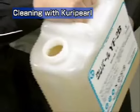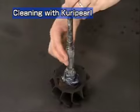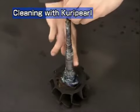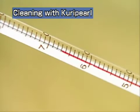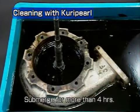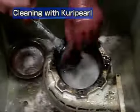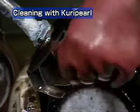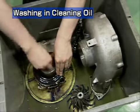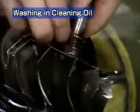Put water into the containers and prepare 20% solutions of agents A and B. Stir them well. Apply grease to the bearing and seal ring in advance to prevent rusting. Heat the cleaning solution to 60 to 70 degrees Celsius and submerge the exhaust casing, rotor shaft and heat insulator in it. Submerge the parts for more than four hours. After removing the parts, wash them with water and rub lightly with a nylon brush to remove any residue. Wash the compressor impeller, compressor casing and bearing housing with cleaning oil. Contamination of the seal ring in particular can cause oil leakage or bearing damage — be very careful not to damage this part when cleaning.